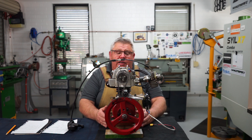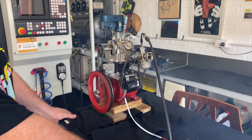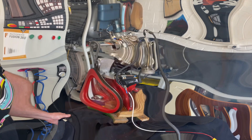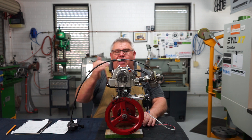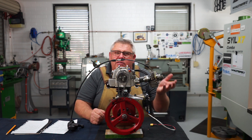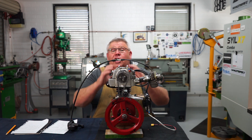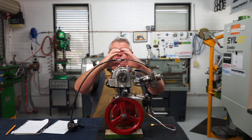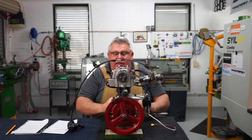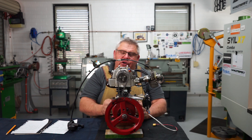As you'll see in the videos, the whole table started to lift and vibrate because this engine came from an air compressor and has no balance. It was designed to run at a certain RPM — the crankshaft hasn't been balanced, it's not a proper crank journal, it's an oversized big-end journal. Normal big-end journals are one size but this one moves around eccentrically. So this probably wasn't the best donor compressor to use.